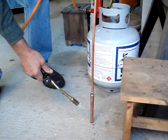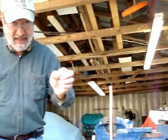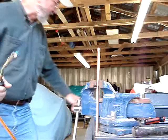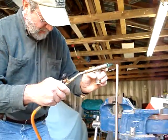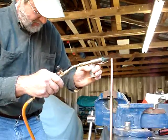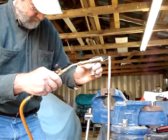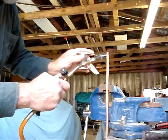There, I feel it pushing my finger off the top of the tube. So I'm going to take the quarter-inch end cap to fit on the 3/8 OD tube, put that on there, and using a lead-free solder, I'm going to solder that cap onto there. I've got to heat the copper enough — there we go — solder that cap onto there.